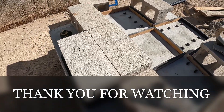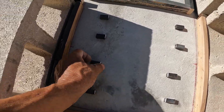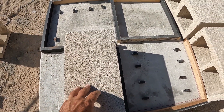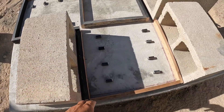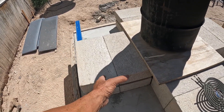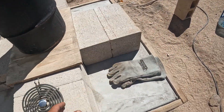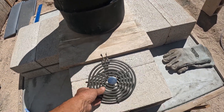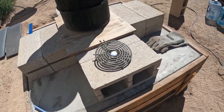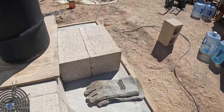Everything's mopped up and ready to go for the next phase. These are my little spacers to hold the cinder blocks up. These blocks are just weights to hold the forms in place — looks like this will work. I'll have a wall here, probably six inches thick, to create the box. It's going to be a four-burner setup. There'll be another set of cinder blocks up top where the heat comes out, so this is the inlet for the cool air at the bottom.